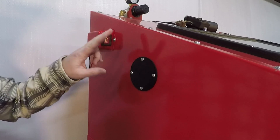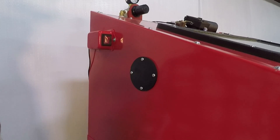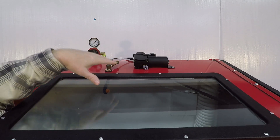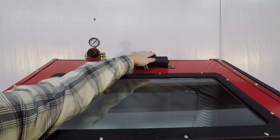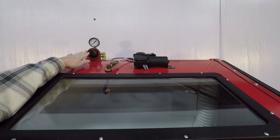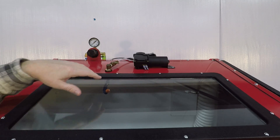I was able to wire in my two LED light bars into the factory Harbor Freight switch. I used a simple ball valve for my wiper fresh water. I also installed the upgraded wiper motor, and it is switched right here as well. I wanted to be able to see the pressure as I was blasting and not have to look down in front of the cabinet.